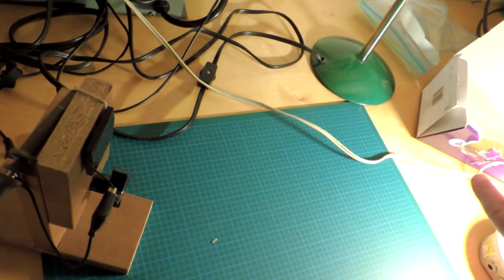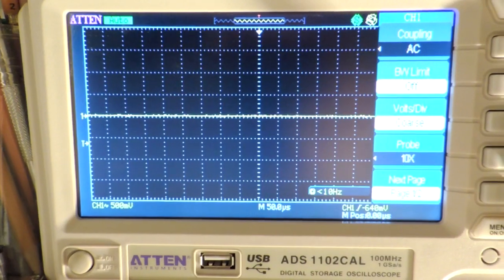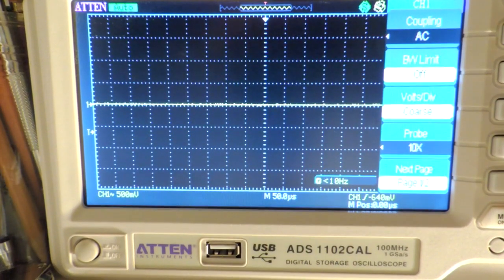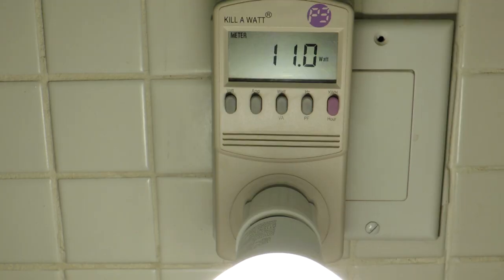Let's talk about flicker. Just out of the frame is the bulb, and obviously it's shining upon a solar cell. And the solar cell, of course, will convert that light back to electricity. If you look at the waveforms on an oscilloscope, you can get a sense as to the amount of flicker the bulb has. As with every Philips bulb, with one exception that I've torn down, there's just no perceptible flicker. So this is one thing that's been consistently superior in the Philips bulbs.